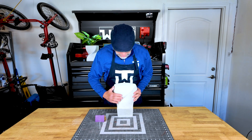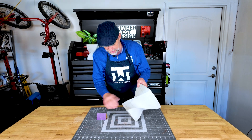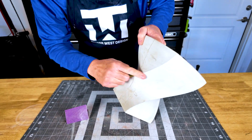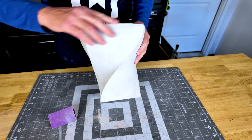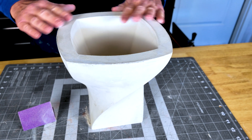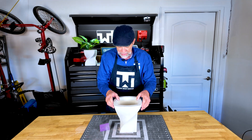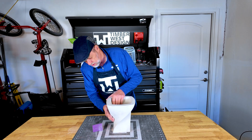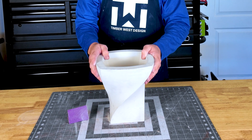I've let this dry a couple of days. There's not much that needs to be done. There's a parting line here so I'm just gonna get a little sandpaper and hit a few spots. I purposely left all these edges sharp — I wanted a nice crisp line on all of this, so I'm just barely touching it, just making sure there's nothing abnormal. On some previous projects I would have put a nice fillet on this, but I like how this looks just crisp and sharp. I'll touch this up, hit a couple of little spots, throw it in the booth, and put some primer on this thing.